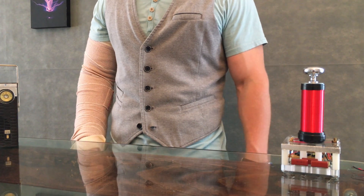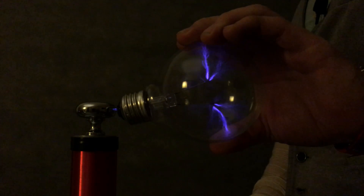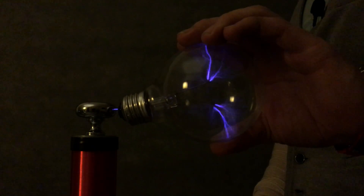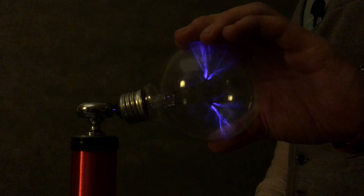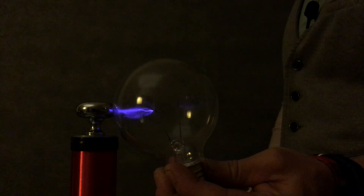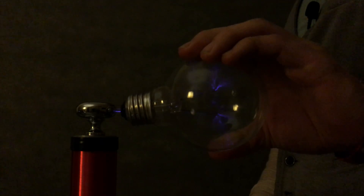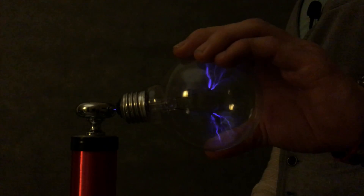And that's really cool — you can push it out to about 20 feet. The second experiment is turning this light bulb into a plasma globe. Simply take your light bulb and touch it to the top load of the Tesla coil; it should light up a bit like a plasma globe. This is happening because you are giving the electricity a pathway to escape to ground. It goes through the vacuum of the bulb, which is quite easy to ionize, then jumps through the filament into your hand and down to the ground. Beautiful effect.